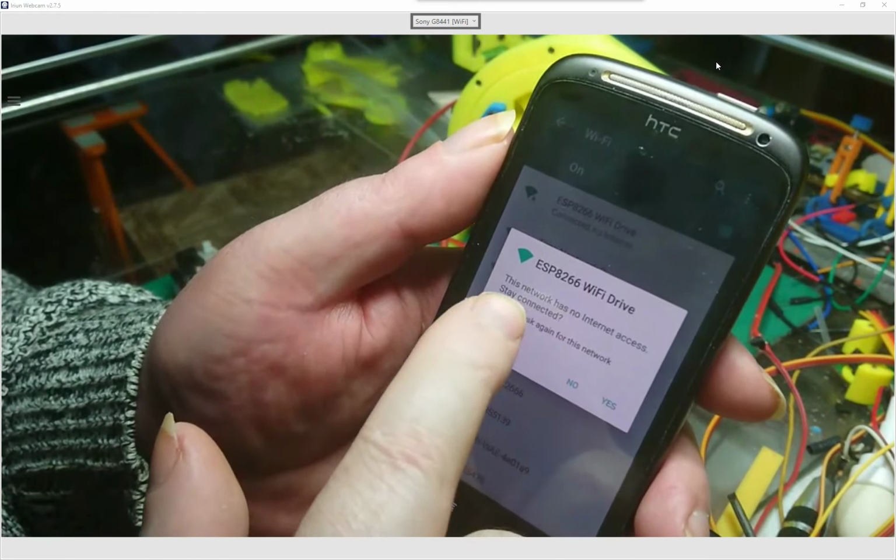With the ESP8266, if you look in your tools and you've got your flash size, you can set aside some SPI flash file system memory. So at the moment I've configured it to have two megabytes of file system. It's basically set aside for putting just normal files. This image here is just a JPEG. Not a JPEG. Is it? Well, it's just an image file anyway.